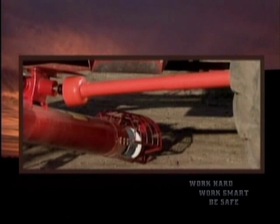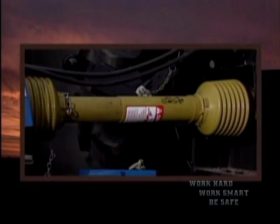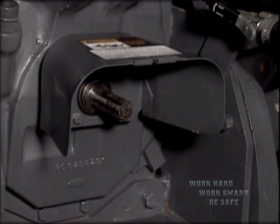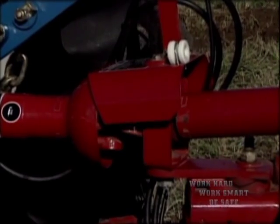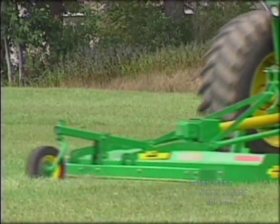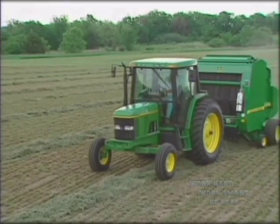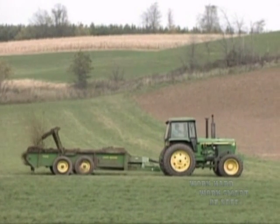This is a driveline, correctly shielded with guards. It has one function: to transmit power efficiently from the tractor to the implement being towed or operated in place. It includes the tractor master shield, the driveline guards, and the implement shield. Accident investigations revealed that virtually all driveline farm-related accidents happen when drivelines are operated without shields or guards, or have been poorly maintained. Don't remove or modify any of them, and don't attempt to operate machinery without the shields and guards in place.